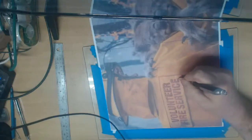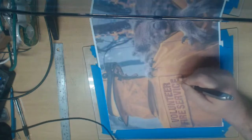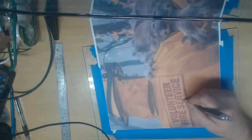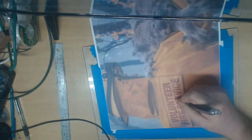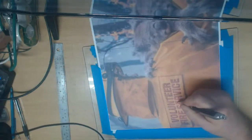K. Meyer says, depends on the thickness of the wood, right? I'm just going as small as the wood will allow. Yep. I don't always base my blade size on the thickness of wood either. A lot of times I base it on the detail and the size that I have printed the pattern. Even if it's on a piece that I know is really too thick for the triple zeros, certain areas I'll try to get as much as I can with that triple zero before I absolutely know I need to upsize and go back to the double zero or zero.